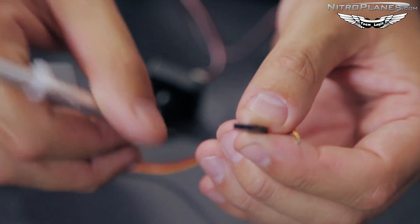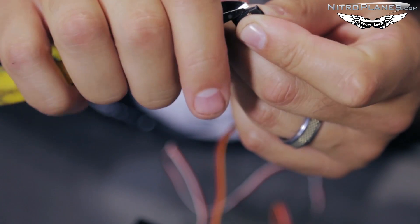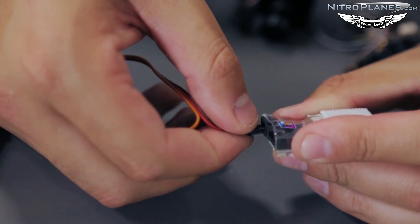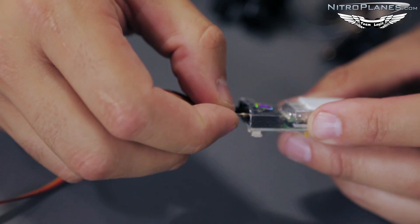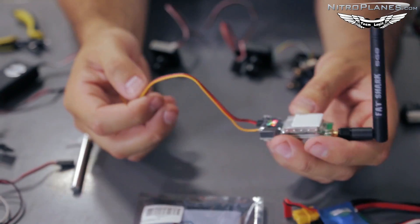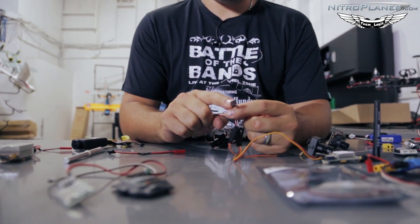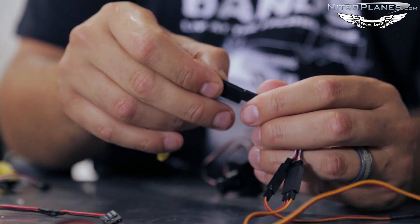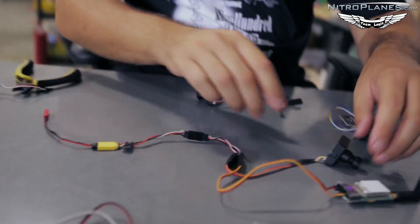All you need to do is take a sharp blade, pull out the video cable, clip half of the servo lead, line up your polarity, and now you've got power established. The next wire is the yellow or orange wire depending on which servo wires you use, and you can simply pop this onto the video lead. Now I've got a good connection ready to receive a video signal. I've got a few different cameras here — all I need to do is apply power to the red and black wires, and now we've got an FPV system set up and ready to transmit.